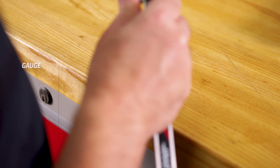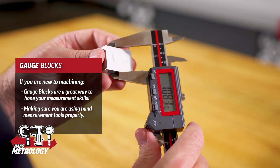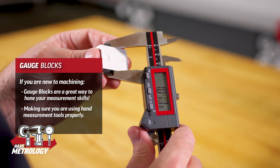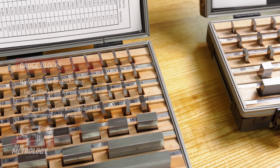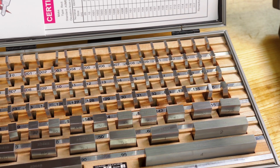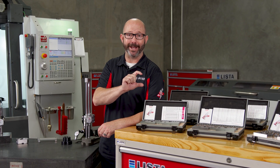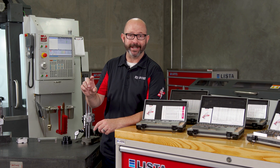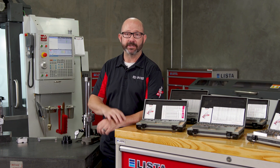And if you are new to machining, they can be a terrific tool to hone your measurement skills, making sure that we aren't pushing too hard or too lightly with our other hand measurement tools like calipers. A good set of gauge blocks is what connects your shop to the rest of the world, making sure that one inch in California is the same as one inch in Ohio, making sure that we're all traceable back to the same outside sources.